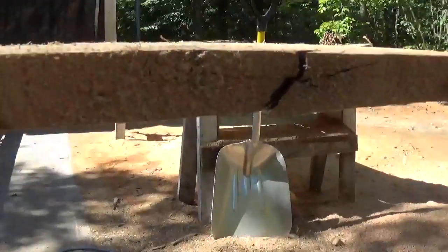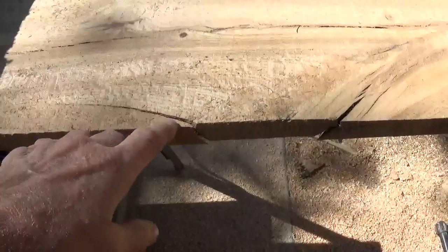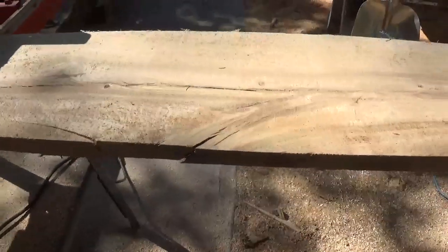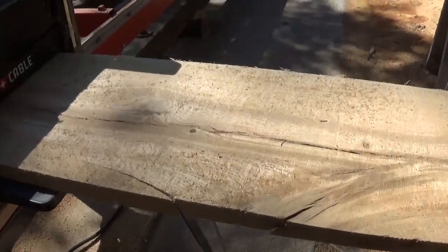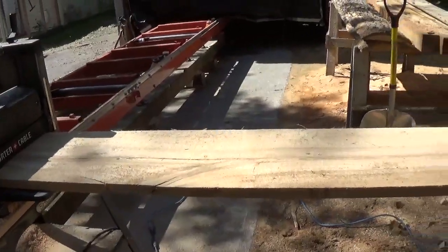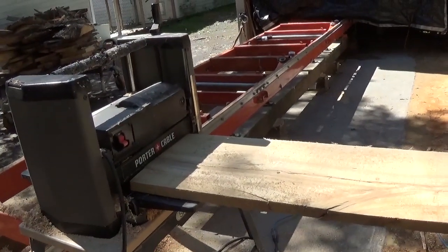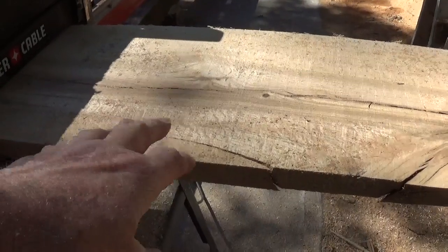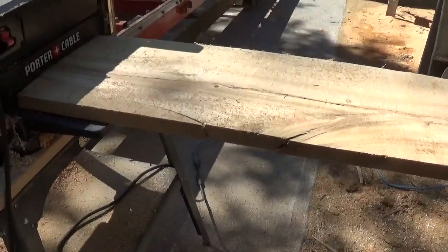But this right here is what can be a pain, because sometimes as you cut it, this piece may slip down or up and hold you up somewhere on your planer bed. So you have to work with that a little bit slowly to see if you can get through it. The best thing to do is, if they're sticking up, put them up in the planer so you can cut them down. If you have somebody helping you, they could take a block plane and possibly shave some of that off real quick, so you don't have to run through the planer so many times. If these break off, sometimes they slow down getting you through the planer. So it can be a bit of a pain in the neck to work with.